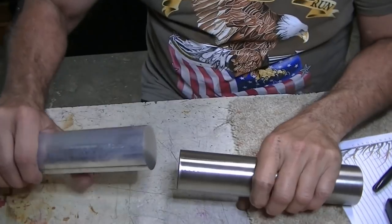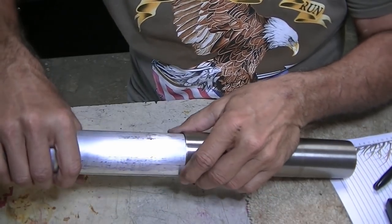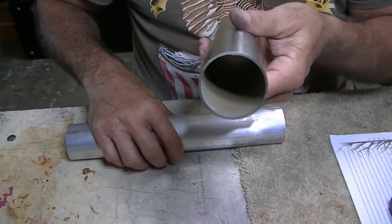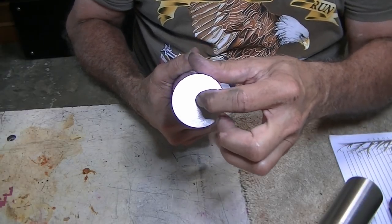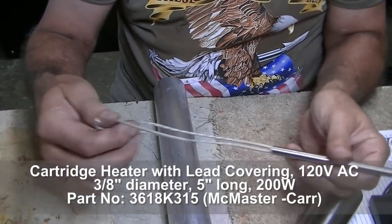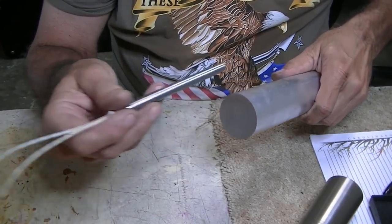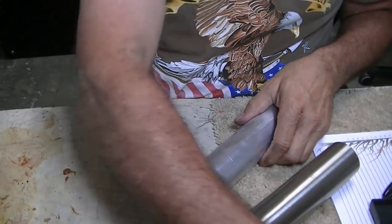I think I've got a problem — I was going to put this aluminum inside this pipe, but it doesn't go. The aluminum is the exact same outside diameter as the pipe's inside diameter. The aluminum is two inches and I want it to go inside this pipe, to take up the space and so I can drill a hole exactly the right size for the heater. This is a cartridge heater from McMaster-Carr — 110 volts, 200 watts. I need to drill a 3/8-inch hole and put the heater inside.